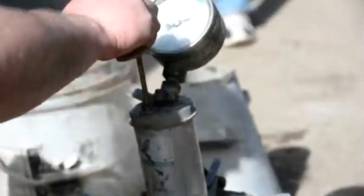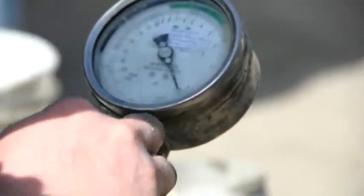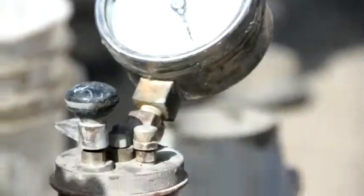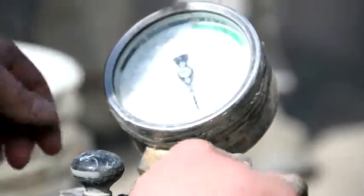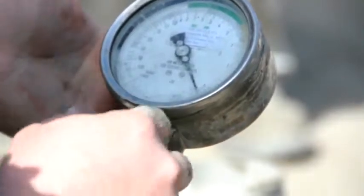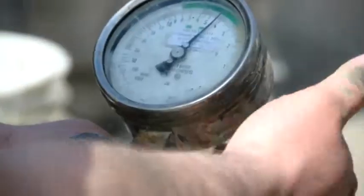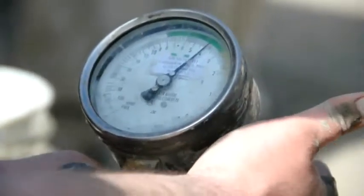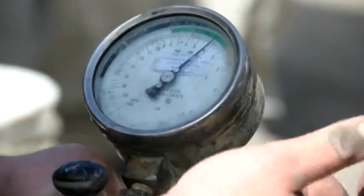Pump it up to the preset value — the preset value on this air meter is 2.5. Every air meter is different, so pay attention to that. Set it to the preset value, run a little bit more water and air through the pet cocks, close the pet cocks, and adjust your preset to exactly on. Then release the air, tap the back of the gauge, and take your reading to the nearest tenth of a percentage point — in this case, 3.8%.